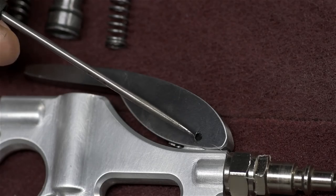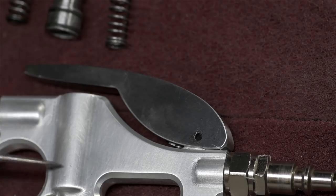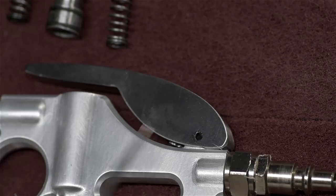With the lever attached, these two bumps behind the hinge set the height at the valve. And if I did my math right, the valve should be in the right position so no air gets underneath of it, but I still have some spring preload against the lever. That higher spring load from the slightly taller spring will preload the lever up against that stop, taking up any of the, I guess, sort of slop or clearances, giving it a much better feel.